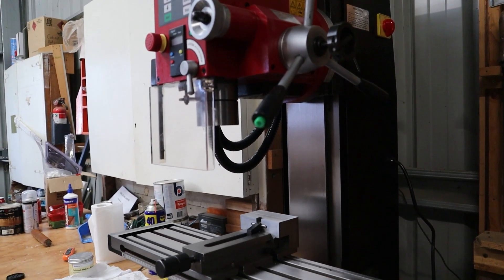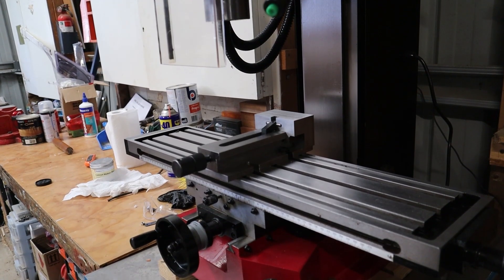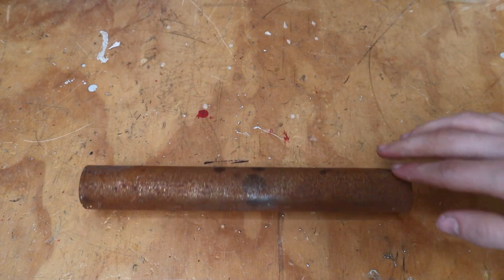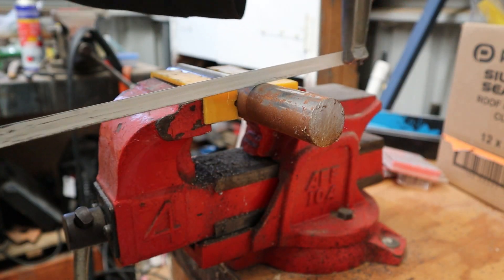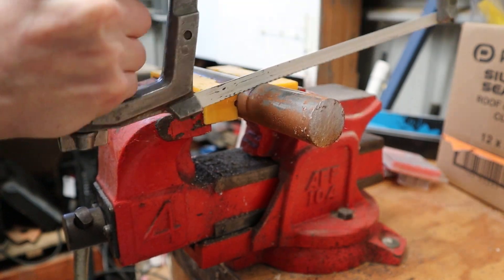We've had a good look over the milling machine and everything that came with it, so let's test this thing out and make a quick project. I found a scrap bit of 32mm round bar in the shed and I think it's going to be a perfect candidate for a fly cutter. I chopped it down to about 70 millimetres using a hacksaw — it took about 3 to 4 minutes, but at least I don't have to use the cut-off saw.